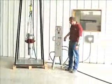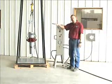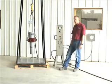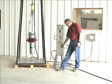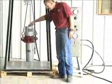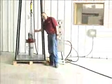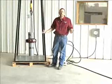As the driller comes down, you would be in the lift position. When it gets close to the next joint you want to screw it into, you would drop it to the lower position on the control panel. This valve right here allows you to have precise control on where you want that casing or tubing to land. As I just lowered it down onto the next joint, we can push it and get the thread started so you don't slam the threads together and damage anything.